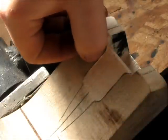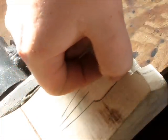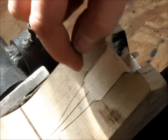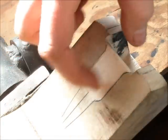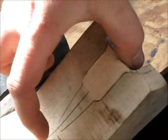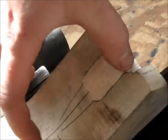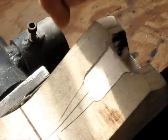So I took some chisels and came in just inside the lines here, and I only did this one little section because right now this is all that's touching on the tang, is just in this little area. And so I want to work this in small sections until I get it completely to where it's all touching, and then I can start really deepening it a little quicker. But for now, since I'm still primarily working this whole section, and this whole section has to go down as one piece, I'm working it in small areas that are just the spots that are touching.